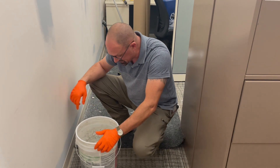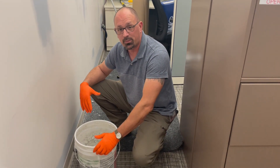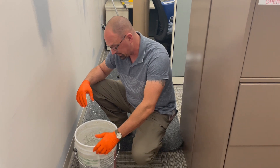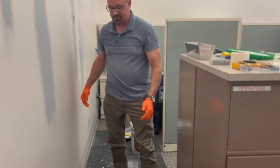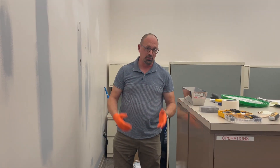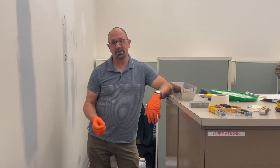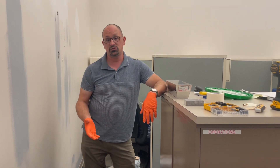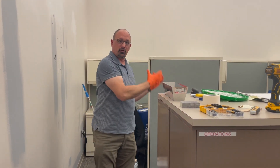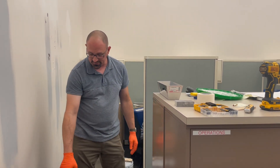I like to scrape everything down. When I get a bucket of pre-mixed, I try to get what I'm going to use that day — if I need a full bucket, I run through it; if I need a smaller amount, I do that. If you're mixing your own mud, which I ultimately prefer, the advantage is it's in powder form — you mix it with water and you have the ability to mix up only what you need when you're going to use it, and you won't get that contamination problem.